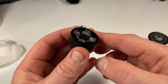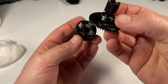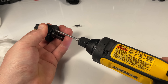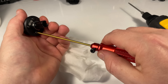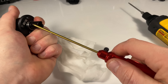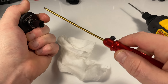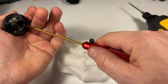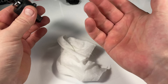Five minutes went by and it looks pretty even — looks good in there. I already wiped the excess. Once you're done, align those holes. Once you're done closing it with a handheld drill or screwdriver or whatever you've got, you can do it by hand for a little more sensitivity and torque them accordingly. Torque one, torque the other, torque this one, and the one on the bottom — nothing too crazy. Spin it around a little bit just so you can see everything is aligned.